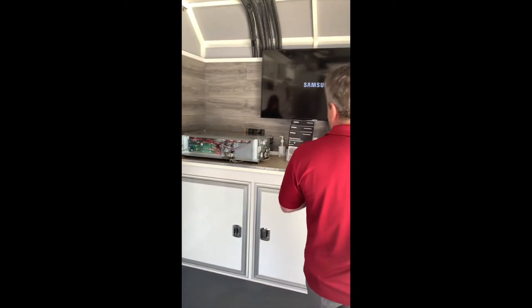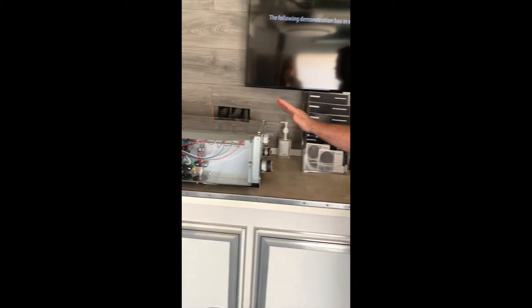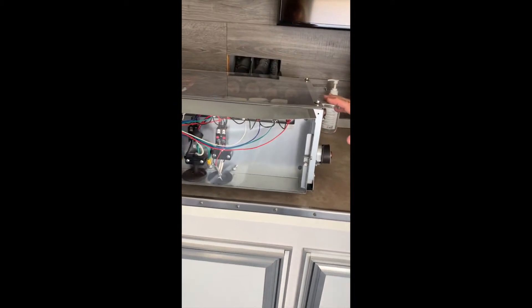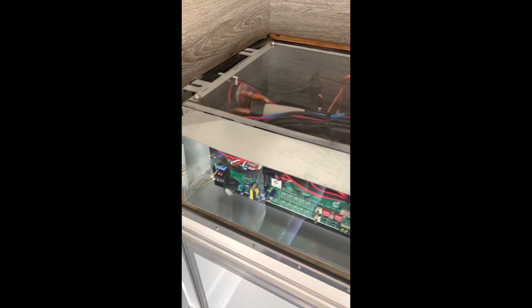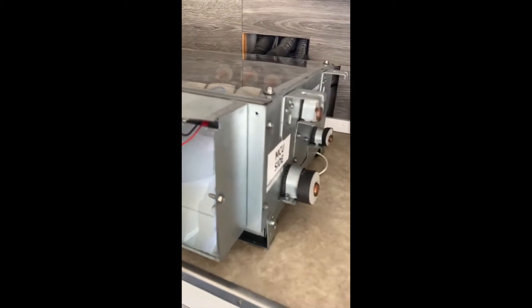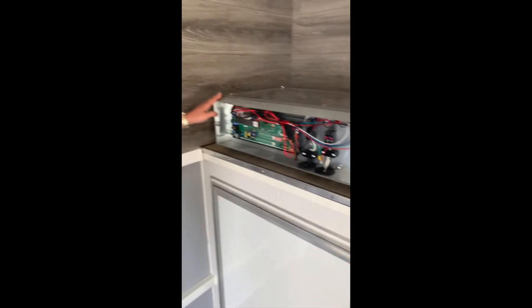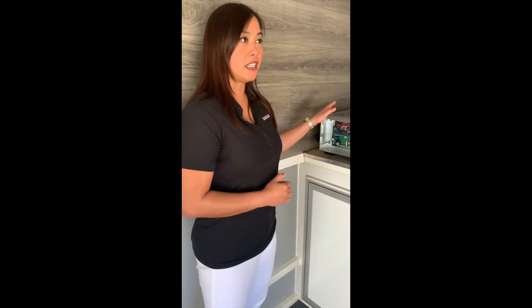So what we've got is what we call our MCU. This is specific to our heat recovery — in our heat pumps you do not need an MCU box; this is designed strictly for heat recovery. It has side ports for easy access during installation. So basically, Dave, I only need this box when I want to do simultaneous heating and cooling? Correct.